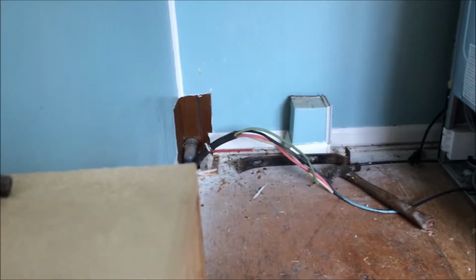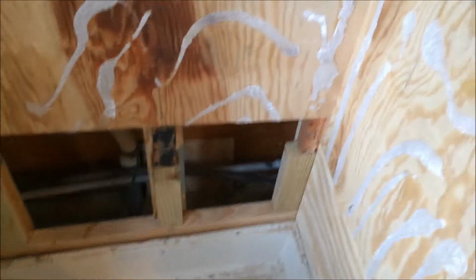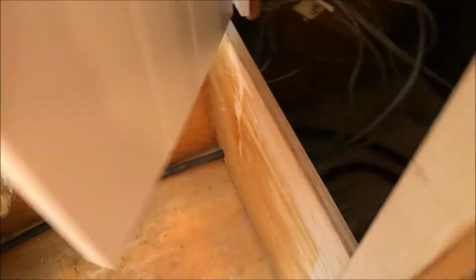Okay. The big wire has been pulled from this corner of the upper cabinet down behind the shower, across the back of the shower, that little plenum which is about to get closed up. And it goes behind the air conditioner. And it'll go, it's right there under the steps. And it pulls into this closet where the panel is, in case we ever need it.